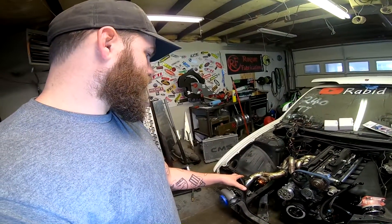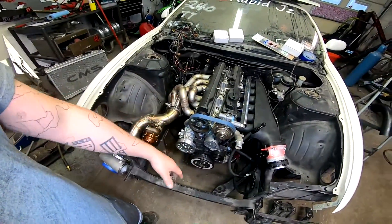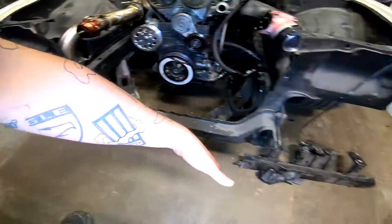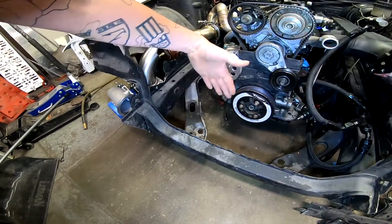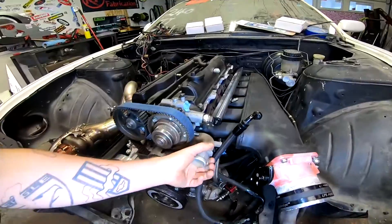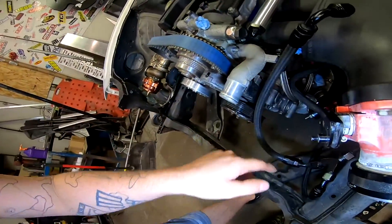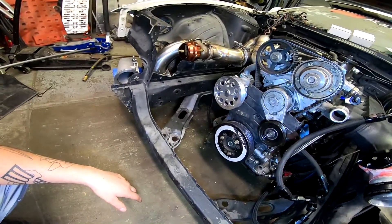Other than the front end, we're also going to mount the intercooler and make new mounts for the intercooler and radiator. The intercooler used to sit a little bit further forward and wasn't even lining up here. So we're going to move the intercooler further back, and the radiator further back too, so it'll be a little closer — though I'm not sure how that's going to work clearance-wise.